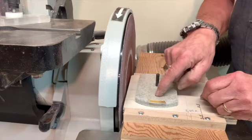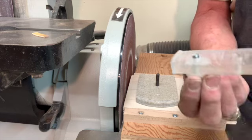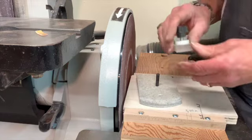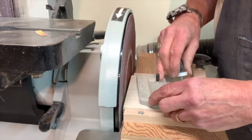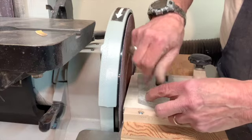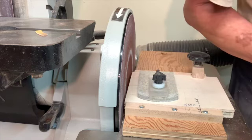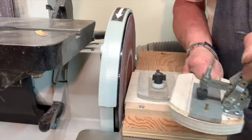You need a way to hold your work down — you can't just hold it with your finger. I made this out of half-inch thick acrylic; it has a little lip on the end that holds down on the work piece. I drilled a quarter-inch hole and a mounting hole through both pieces at the same time, then threaded for quarter-20 to fit a little knob that acts as my clamp. I also have another version that uses a toggle clamp — overkill, but it works.